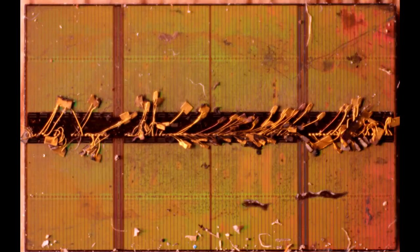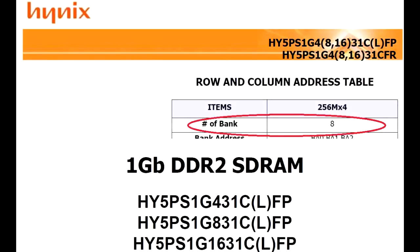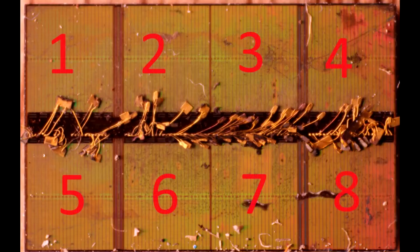To finish off, let's come back to the DRAM silicon. Here's an individual die. To figure out what we're looking at, you can pull up the datasheet — the DRAMs are marked in a way that gives you a public datasheet. It's a DDR2 memory, a one-gigabit part — certainly an elderly part now, probably about 10 years old, which makes sense since the computer it came from was scrapped. The datasheet says it has eight banks, and we can see that — one, two, three, four, five, six, seven, eight. You can actually start matching up the datasheet with all sorts of features on the actual device.